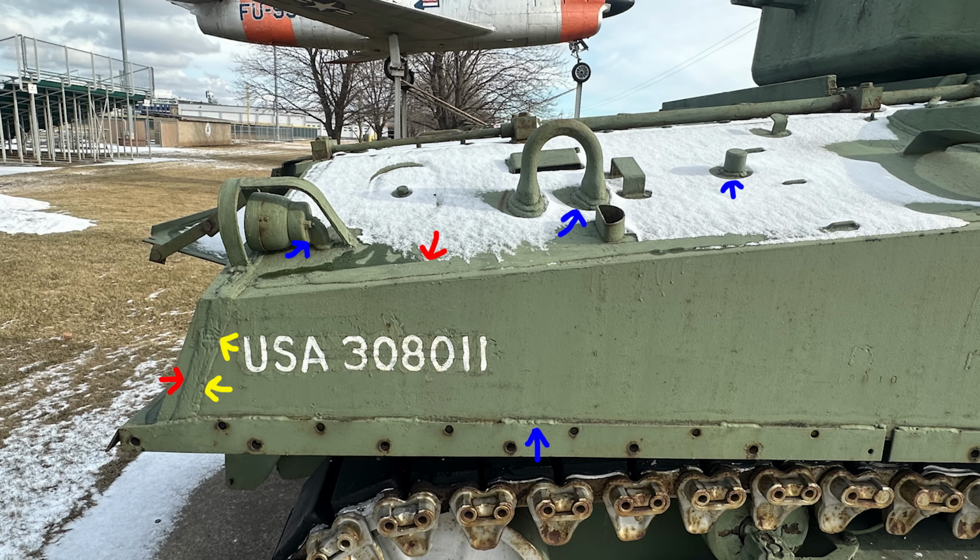Now, self-shielded flux core actually did exist, sort of as a military secret going back to probably the early 40s. However, that was not used as far as I could tell on tanks. It was all used in the shipbuilding industry. The main reason was ships themselves often weren't built with high strength alloys like tanks were, like tank armor, and you could use basically wire that was suitable for mild steel more or less on a ship or even parts of a submarine without any issue. But on a tank where you're welding higher strength alloys, there was no flux core wire that I'm aware of that would have been available in the early 40s to weld them.